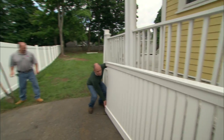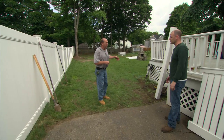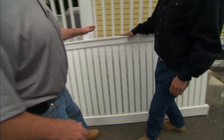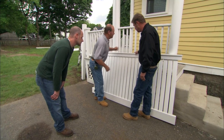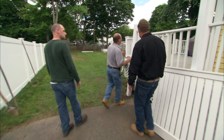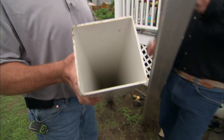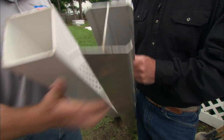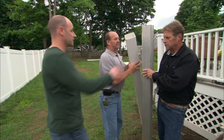This is where our double driveway gate is going to go. It's going to open in and be big enough to drive a car or truck through. This is the fence we're going to make the gate from — it's a four-foot tall vinyl semi-private fence, which means there's a half-inch space. Now we're going to set the post for it. As you can see, this vinyl post is a hollow piece of vinyl. We have to add an aluminum i-beam inside to give it a strengthened structure, and it has a flat surface to mount our hinge screws into.